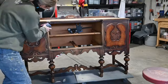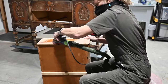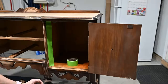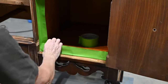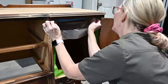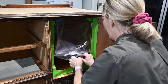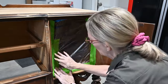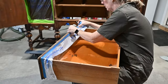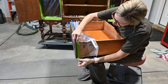I decided to go ahead and scuff sand some of the piece — the drawers and the parts I could get to at that moment. The outsides of the drawers needed some sanding down for a little refresh. Then I'm taping off the doors where the cabinets are so I can paint with the doors on and not have any overspray from my paint sprayer go inside. I use big frog tape first, then painter's tape with attached plastic to finish the job, and I also cover the flush drawers with plastic and spray with them in.